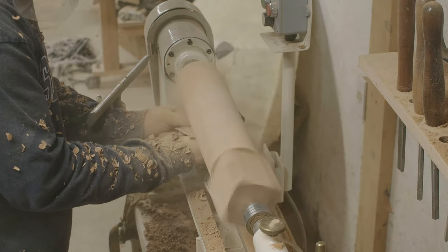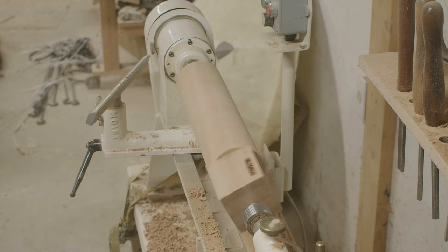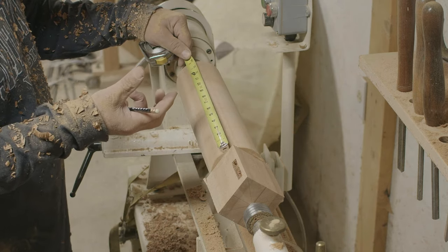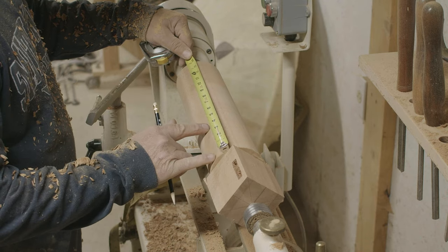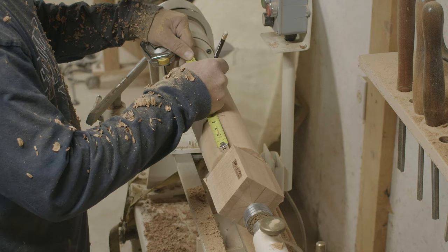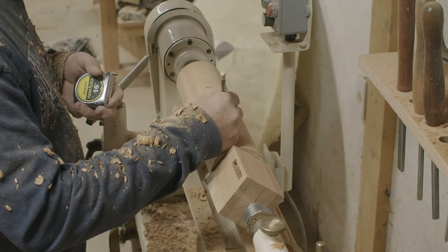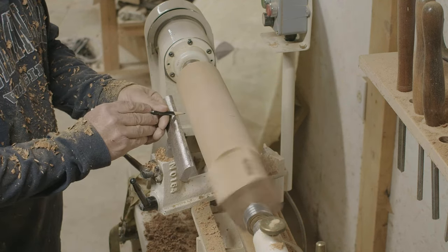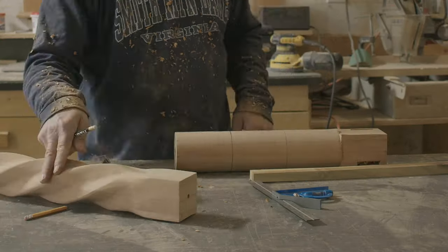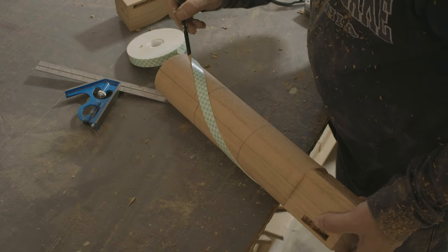What I'll be doing next is, as I'm getting this cylinder down to size, I'm going to turn that. If this was a longer leg, like a dining room table, I would do it a full turn, which would be four quarters. In this case it's shorter. I'm basically taking the cylinder and I've turned it into thirds. Before I did that, while I still had square stock, I made an X at the bottom foot so I knew where my corners once were. By having where the corners once were, I can now mark out the center of the knee, which is the square spot at the top of the leg. That's where the cove — the low point of the curve — is going to blend into, which is the center of the knee. I'm taking some double-sided tape, going from one corner just back up to the center of the knee. That's going to be this low point of my cove.